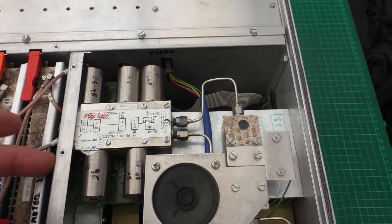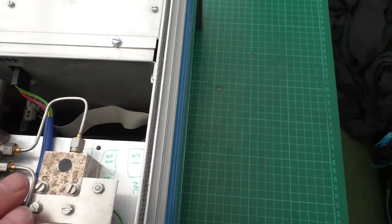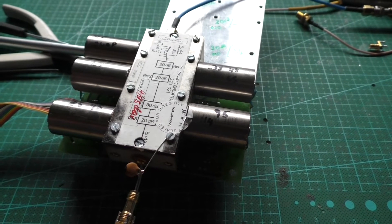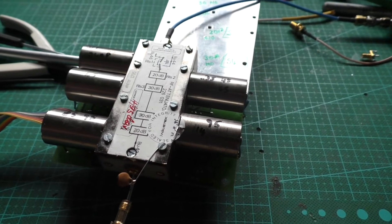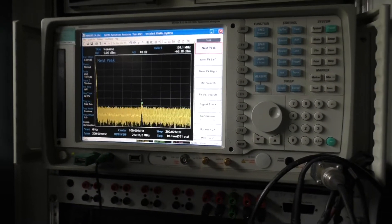I'm going to take this out — there are only a couple of screws on the side. You've got to take this cover off, this part removes quite easily once you remove the screws and just drops through. I'll remove the RF attenuator, part number 226031S. Basically I'm feeding in 100 MHz at 0 dB and recording the output on my spectrum analyzer.